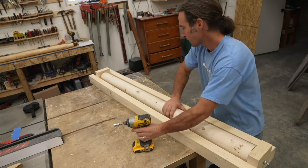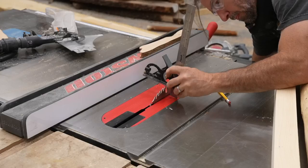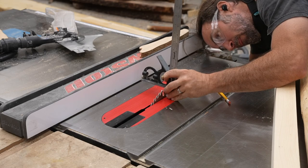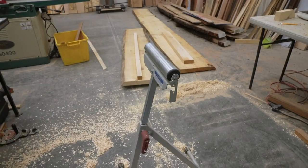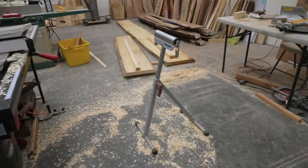The log is put in the jig and the bolts are tightened — the log should freely spin in the middle. I set the height of the table saw to be a little bit lower than the tenon size I want, which allows me to sneak up on the final size. I set the fence so the middle of the blade is dead center underneath the bolt, and the back side of the jig has to be supported — in my case I use an outfeed roller.